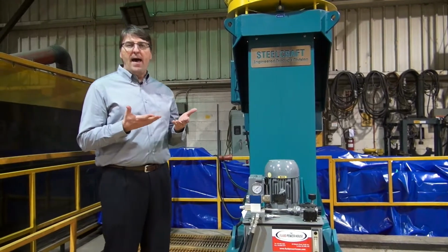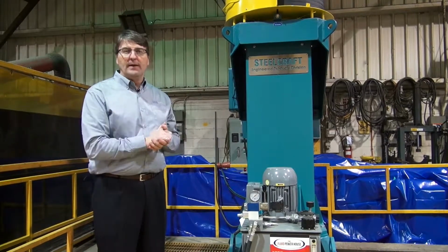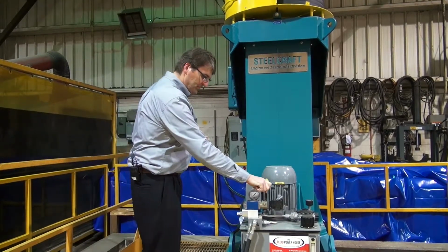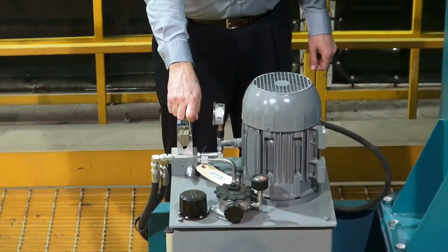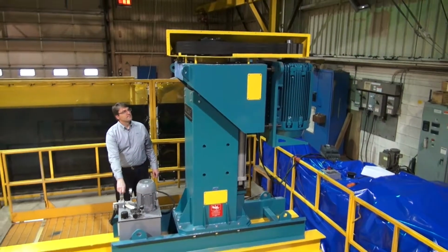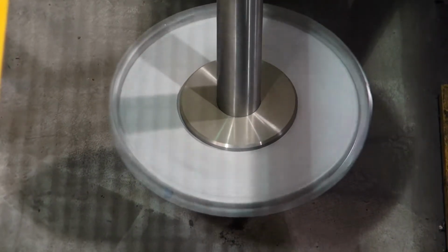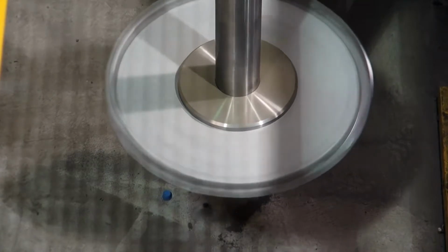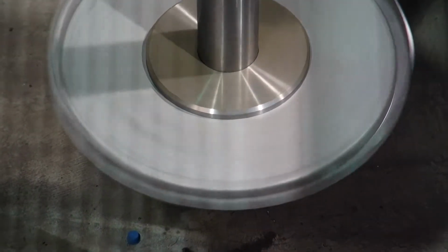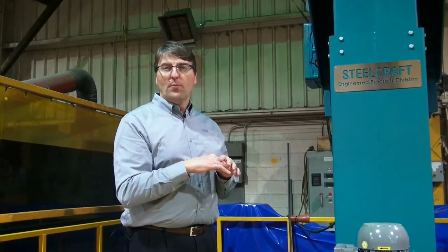Typically, the blade would be raised in the batch as the actual batch volume increases, as well as if there are difficult powders that are on the surface and they need to be incorporated. By raising the blade while mixing, the vortex and fluid velocity at the surface of the batch will become much more intense and allow those difficult to wet powders to be readily dispersed in the fluid. Once the unit has been fully raised and powder incorporation successful, we can then lower the blade or position it mid-range depending on the process needs.